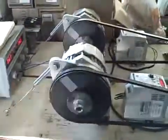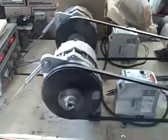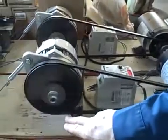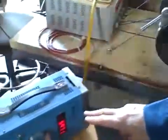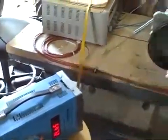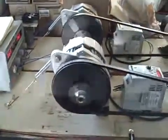This video is another demonstration of synchronizing two AC generators. We have these two simulated generator stations being spun by induction motors and VFDs. We have pieces of tape put onto the sheaves on the generator shafts, and a stroboscope making a flashing light to allow us to visually freeze those pieces of tape and see the relative positions of these two shafts.